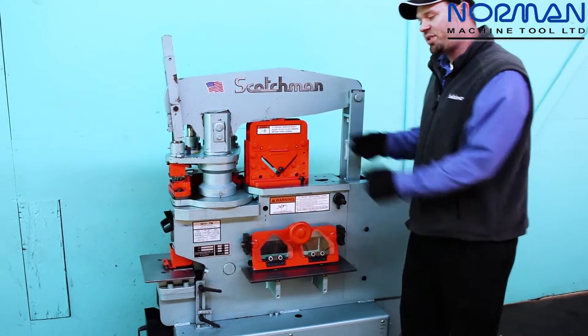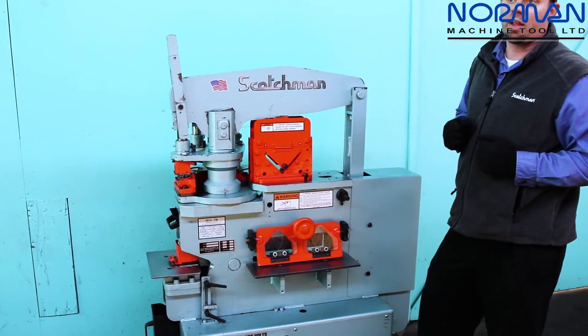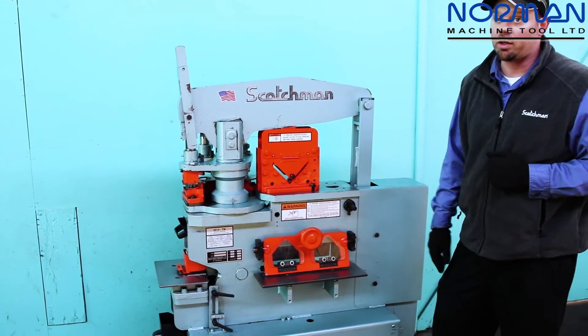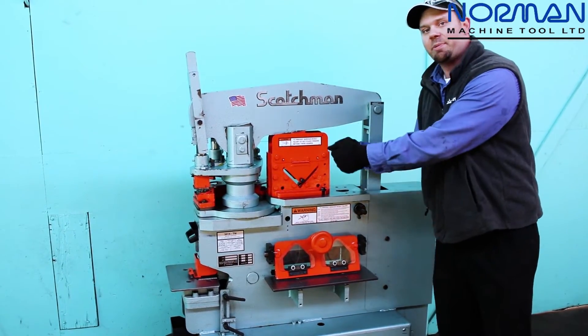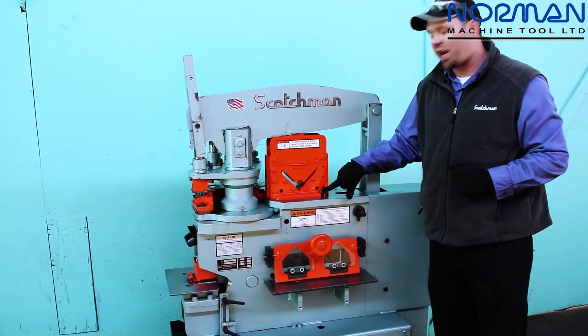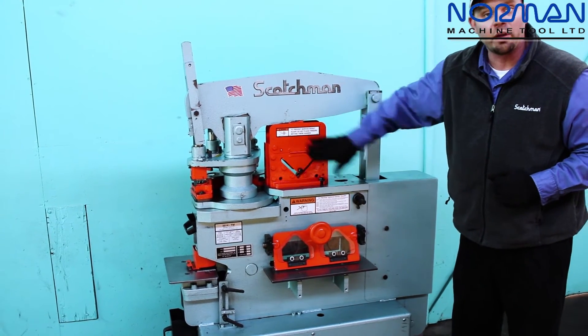In addition to that, we can always take out our brake and put in something like an open-end brake, a channel shear, a V-notcher, or a unistrut shear. This is our component tool design, where the angle shear is made to be taken out and the next tool slides in with a very fast tool change — only one or two bolts back here holding the tool in place.